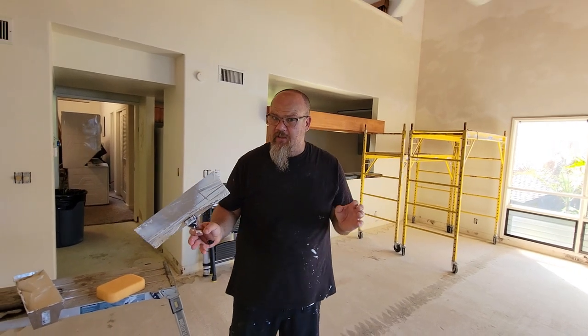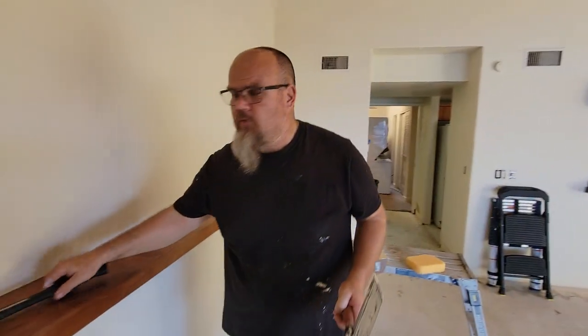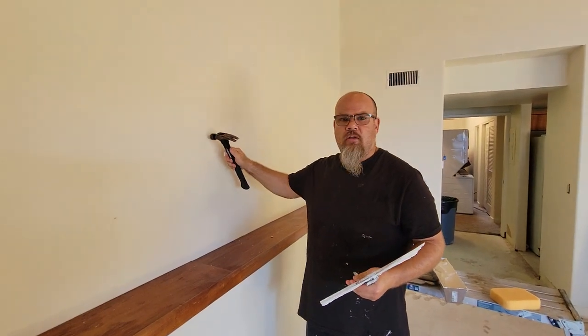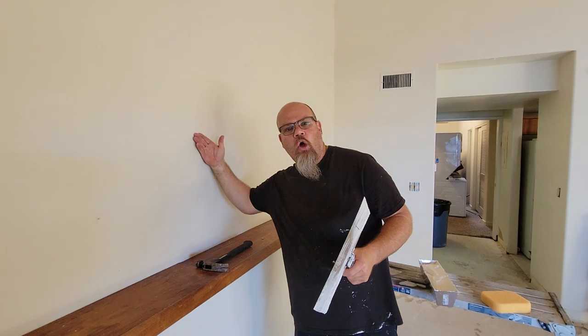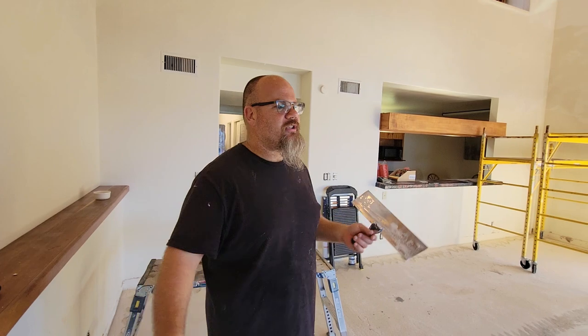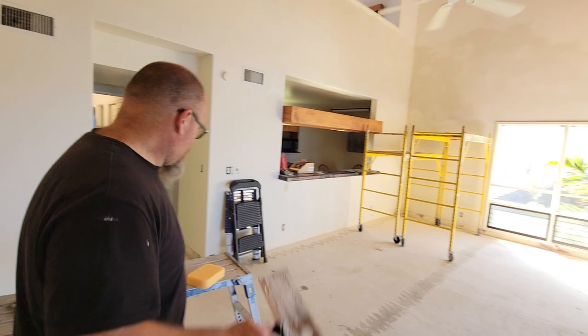If you're just starting this, sanding is your friend. Put it on thin — you can do multiple coats if you want. Have a hammer ready: if you have a drywall anchor or a high point in the wall, tap it in to make it a low point, then you can mud over it. Also, if you have gloss paint, you want to de-gloss it — sand it a little bit with 220. You could also use TSP, trisodium phosphate, to clean the walls, but you can just sand them and wipe them down and it'll adhere really well.